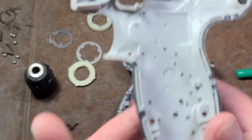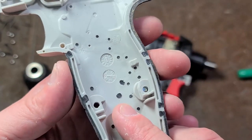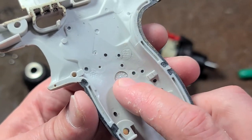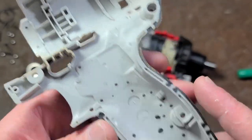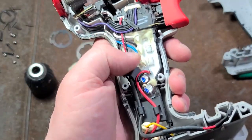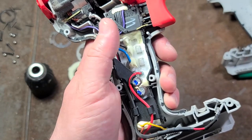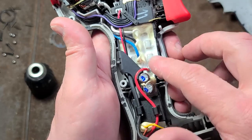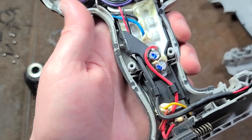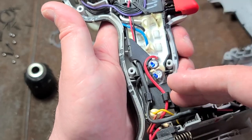Kind of an odd little system. Many of these reverse switches — this spring will be the detent, riding inside this groove. You can see the little recesses right in that groove; that's what this is going into, to lock it in first or second. The way these gearboxes work, sometimes they don't quite align and don't want to shift properly, so instead of the switch jamming, you flick it and it puts spring tension on this arm. If it doesn't totally shift, as soon as you bump the trigger, it'll snap into place.